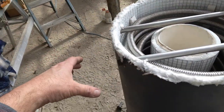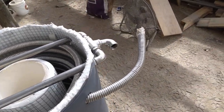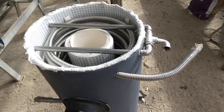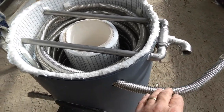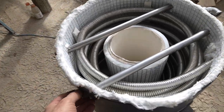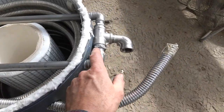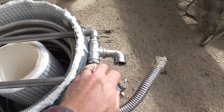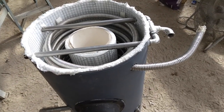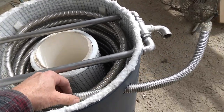Now I'll take it all through here and I'll have to get a fitting on here, so I'll have all the connections on the exterior in case something leaks. I don't want anything leaking on the inside. It's not going to be under a lot of pressure or anything. I got Teflon tape there, and I'll have it all full of water before I start a fire in here — I don't want a fire in here with empty tubing. It probably would burn them up and damage them.